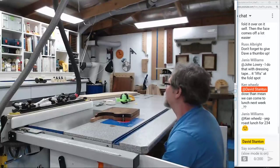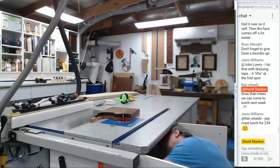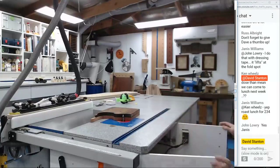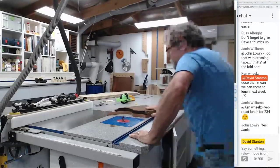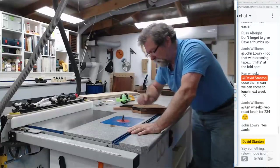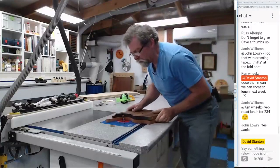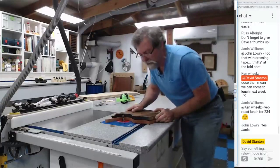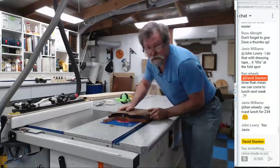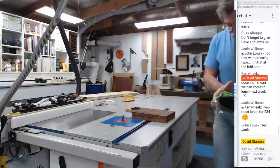All right. Get my head under there and see where we're going. There we go. Beautiful. In. Okay, now I can focus for a second. It's going to be turning this direction, so I will need to approach it from this side. Don't approach it from the other side, because you're going to do what's called a climb. Climb cuts are cleaner, but they want to grab a hold of the job and pull it away from it. So I need to go over here,